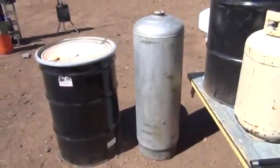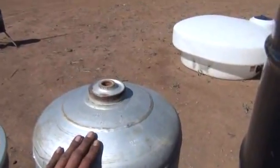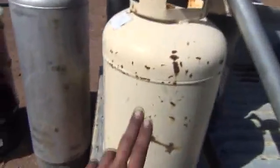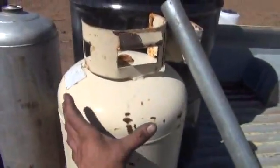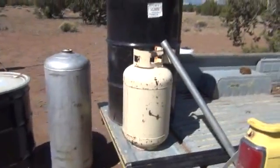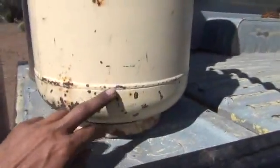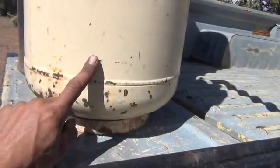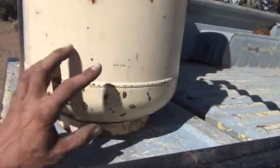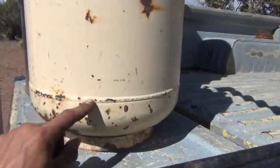You've got the one big tall tank here. That big tank is our material tube. We're going to cut a blow-by pressure relief top with a big spring in it, and also cut the bottom of that tank, and attach this smaller tank right to the bottom of it. This creates a reduction point — that's actually where the pyrolysis is going to take place. Our pyrolysis process is going to take all that charcoal, and at the bottom I'm going to reduce the diameter slightly — about an inch of reduction — to compact the charcoal just a little more. The smoke has to force itself through more of that charcoal, which will help convert more of it into a cleaner syngas with less tar production.